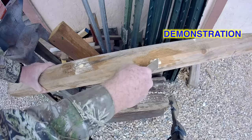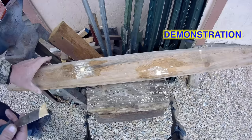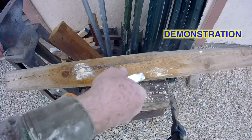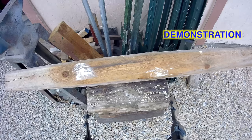If you have too much destruction, spray everything inside and out. If larvae touch any wood that has soaked up permethrin, they'll die within moments of contact. Spray all wood surfaces even if you don't see damage — it may be just below the surface. Spray inside the holes and out and let it dry. If a carpenter bee lands on it, let alone bites it, it will die in short order. When the permethrin is dried, fill the holes and tunnels with wood filler as deep as you can. Since permethrin concentrate is water-soluble, you can mix it into your paint or wood putty to make them deadly too.